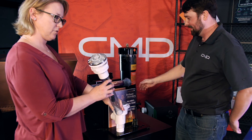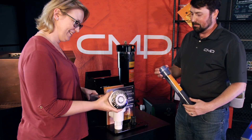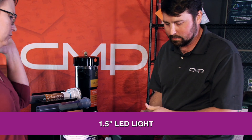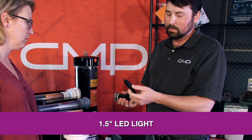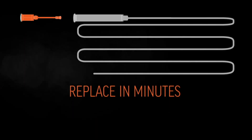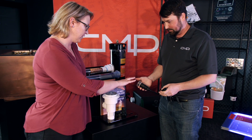What are these guys and what do they do? These are our Brilliant Wonders lights, displayed in these pipes just to show how compact they are. Each of the inch-and-a-half lights comes with a waterproof quick-disconnect cable connector. It's an IP68 underwater connector — it can stay submerged. It's attached at the pool side of the cable, so if you ever need to take the light out or replace it, you don't have to pull a hundred feet of cable through the conduits.